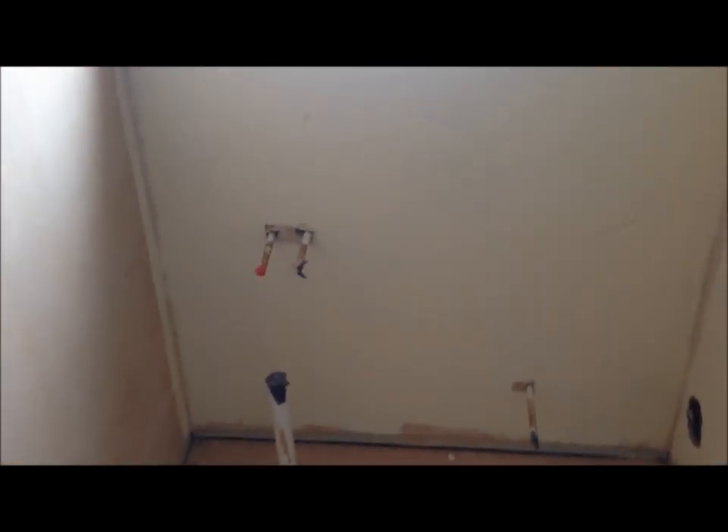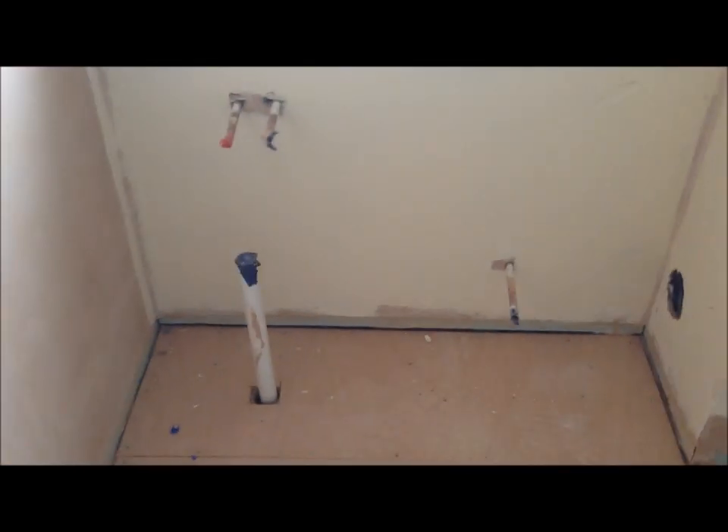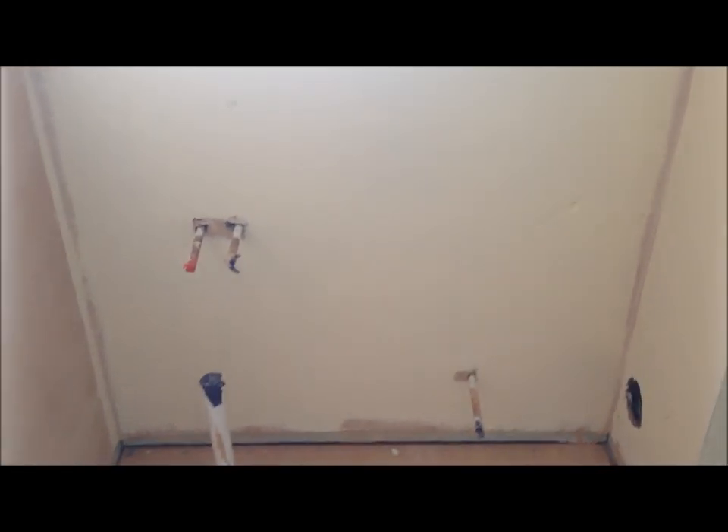In the bathroom: as you can see, this area hasn't been plastered because it's going to be completely tiled. But on that corner edge of the plasterwork, coat that up because nine times out of ten the tile will not go all the way to the edge of that plasterwork where the angle bead is. Also, the toilet and sink will be going in that area, so getting a double coat on that makes life a lot easier for whoever comes in to paint — they'll just have to flip around it with a brush.